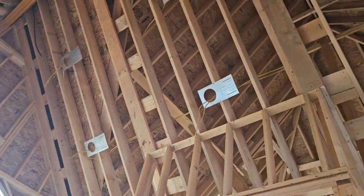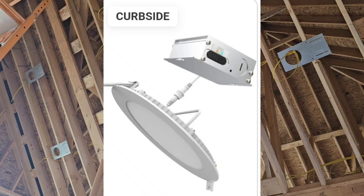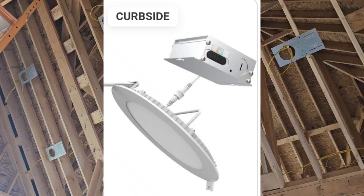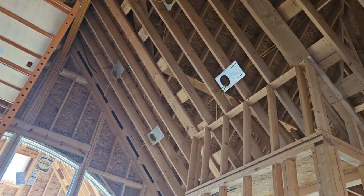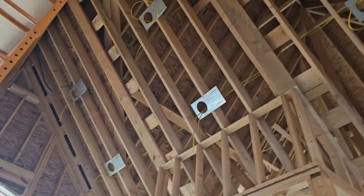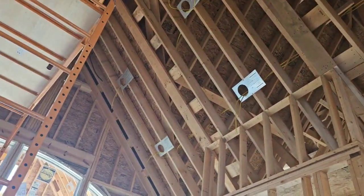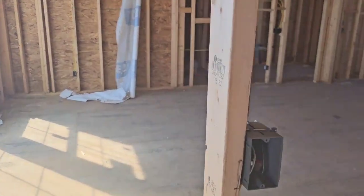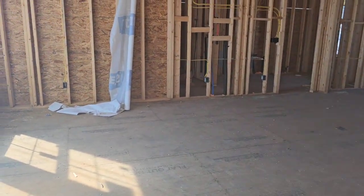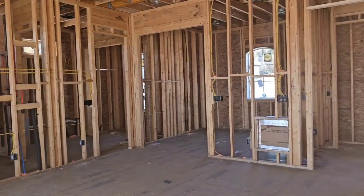This is one of the new products I wanted to show you — wafer plates. I love the wafer lights; I think they're great. They're the ones where you pop the wire down or install the box and cut them in later. I had buddies doing brand new construction jobs with retrofit lights and having to come back and cut 20 or 30 holes in a brand new construction house — I'm just not in that business. So what they've done is create these: after you're done, the drywallers cut the hole, then all you do is come in and pop the wafer can. The difference between a good job and a bad job is five minutes. They used a story pole, went around, and marked every hole at the same spot. It ends up with a premium product.